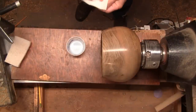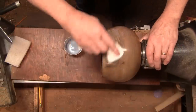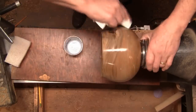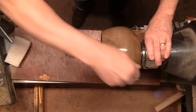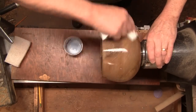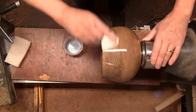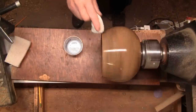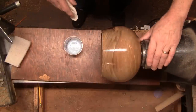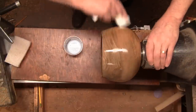This is the polycrylic. I don't brush that on at this point — I'll wipe it on, and I'm not putting a very heavy coat on there. If you do, you're liable to have streaks that you have to work on. If what you're putting on is already smooth, this has a better chance of being smooth after you get it on — kind of like sanding. You want to make sure everything is sanded to where you want it before you put anything over the top of that. I'll just make sure by doing this that it's all covered and it's nice and smooth. If I see any spots that look dry or different, I'll wipe it down like that.